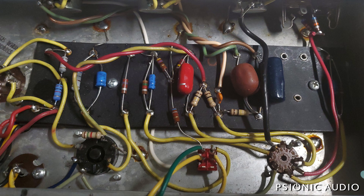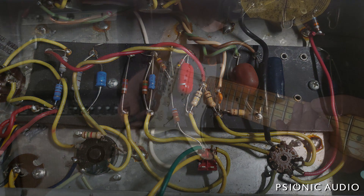In addition to that, I also removed the RCA speaker jack, cleaned all the metal surfaces with Deoxit, put it back together, and then I added a 1.5k grid stopper on the output tube. Fender admitted that on the Champ and the Princeton — their quote 'student model' amps — it's a better design to have a grid stopper resistor right there at the tube socket. So that's added, and I'm really pleased with this. Now let's switch to the Les Paul and do some higher gain stuff.